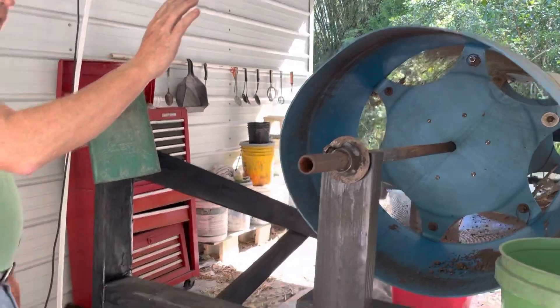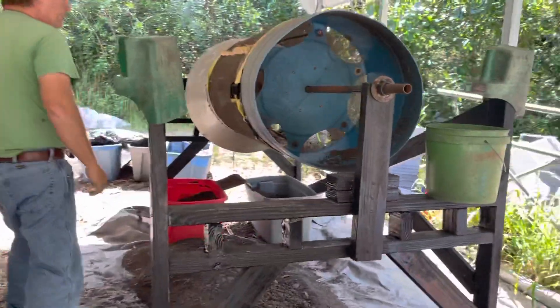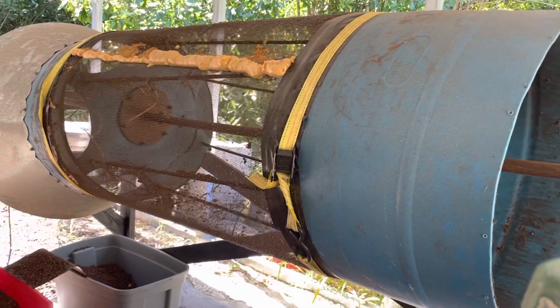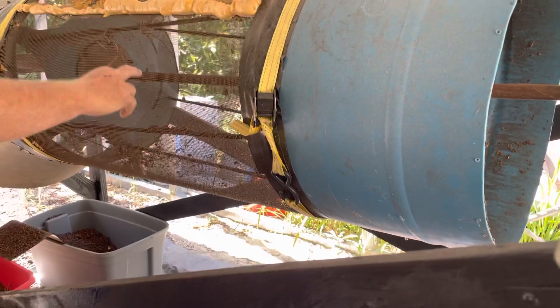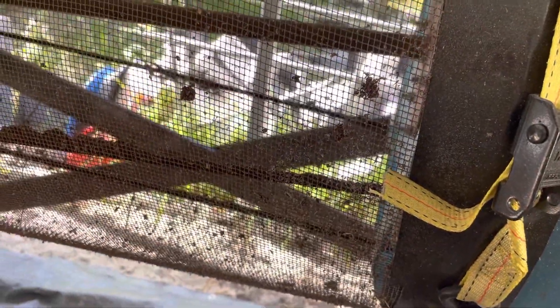You come through here and you'll notice I've got a screen — it's not fancy but it does the job. I seamed it up with great stuff. If you look inside, you'll see there's all-thread inside this trommel, which is used to break down your bigger chunks of castings. Over time, material winds around your all-thread, so you want to be able to get in there and clean it out. To open it up, all you have to do is pop this seam right here.